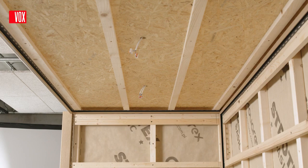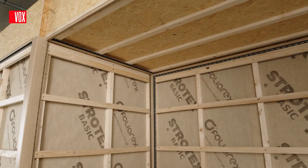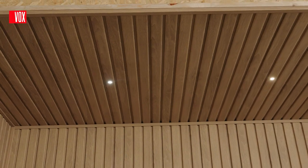If you intend to lay the panels along the recess, then install the substructure profiles or battens as for horizontal installation. If across the recess, then install the profiles or battens as for vertical installation. Where there is a need for edge finishing, SV15 battens should be used. It is possible to install lighting in the ceiling-mounted panels, but this should be planned during the substructure preparation stage.